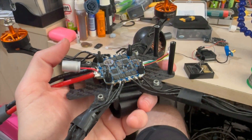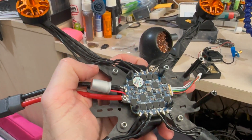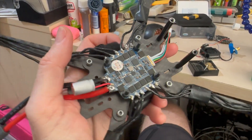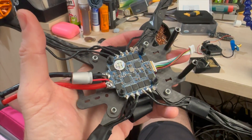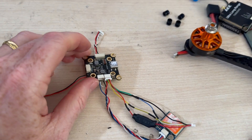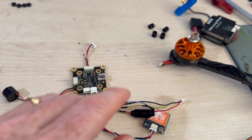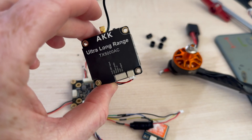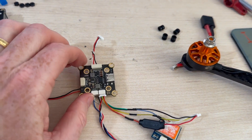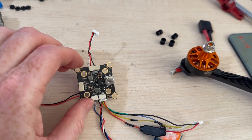First part is done. And this is why I don't like these motors — these wires are absolutely solid, there's just no flexing them at all. Now the flight controller, which I'll have to look up in a bit more detail. The ESC is pretty obvious — you put the XT60 on and then wire in the motors. Soldering is done. We've used connectors where possible. This one goes to the VTX — I said I probably wasn't going to use it because it needed 14-something volts, but it seemed to suggest that the pad labeled 'plus' would take battery voltage.